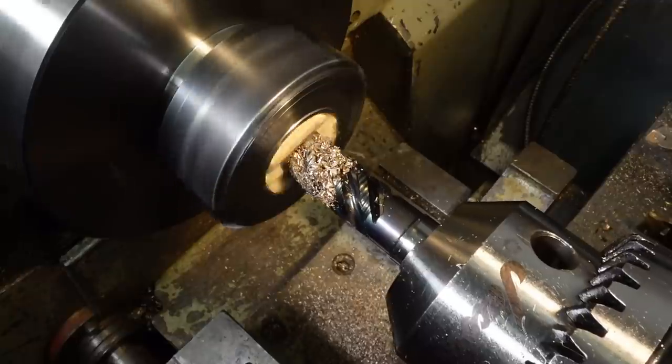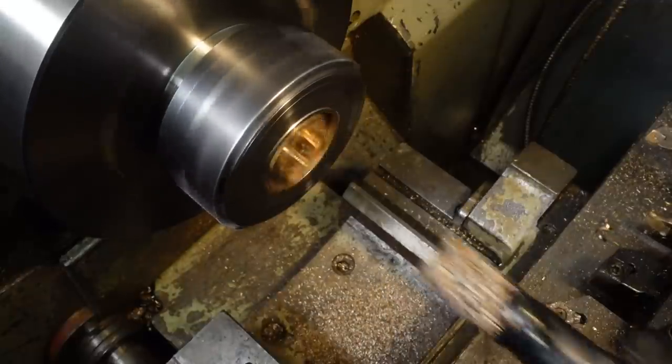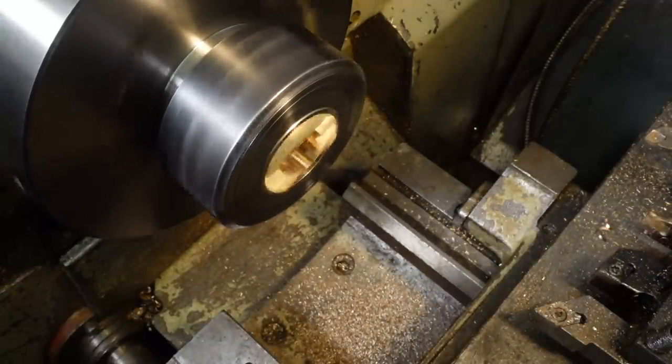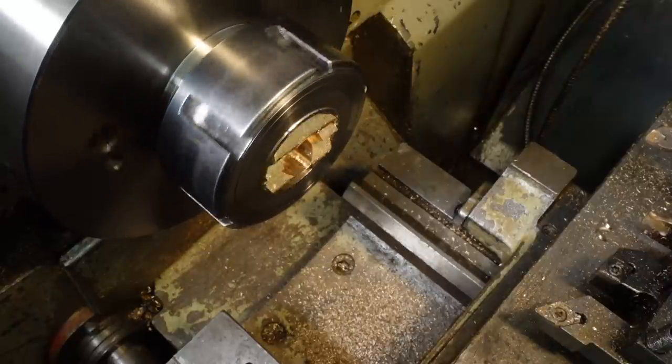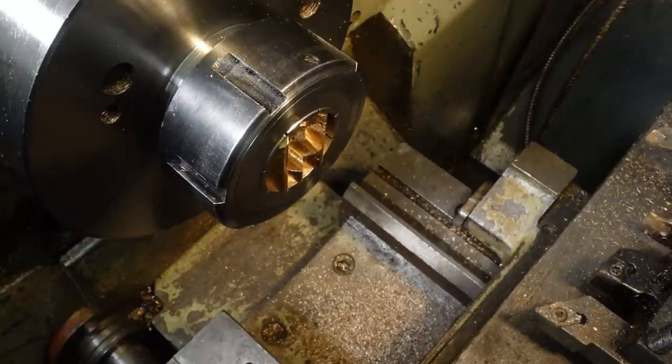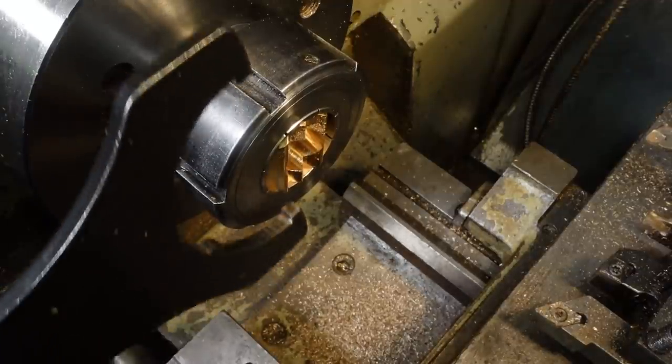I did think about making a collet block end stop, but with the ER40 collet there's significant movement of the y-axis position as you tighten the nut. That makes it hard to set a stop, as the part would jam against the stop as it tightened and cause all sorts of problems.